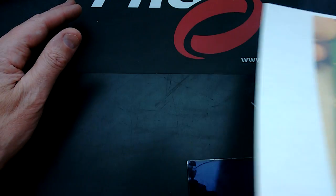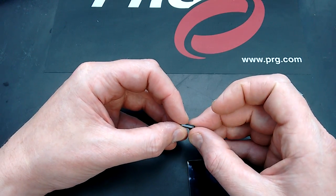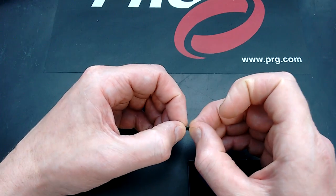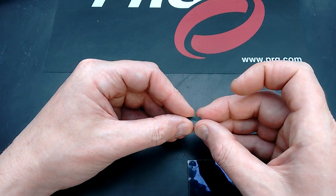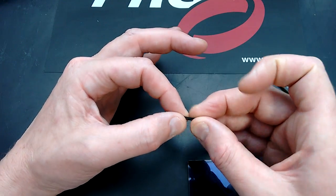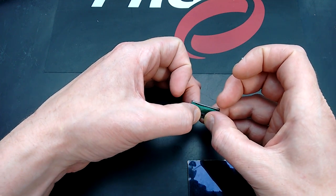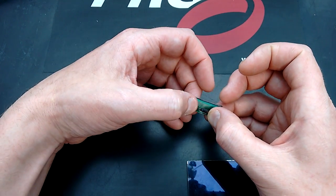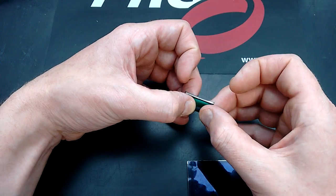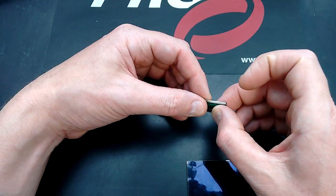Other things worth noting about this display: it does have this little chip-on-flex. This is apparently a little silicon chip, which is the actual active side of it — the side that would normally face up on a standard chip-on-board — and then the little leads are bonded onto it. That's actually placed down onto the flexible film and bonded onto the copper contacts, which is quite an interesting way of doing things. Then they basically flood around the outside of it with black sealant, presumably to protect it from moisture ingress and also to block light from going underneath.